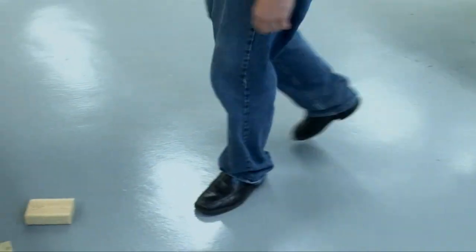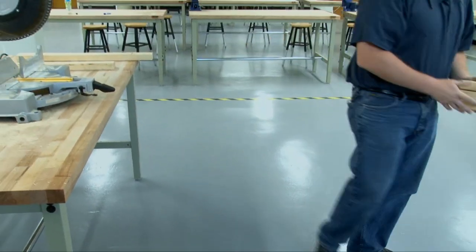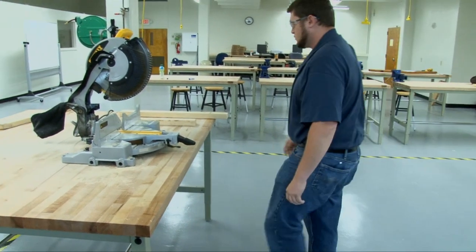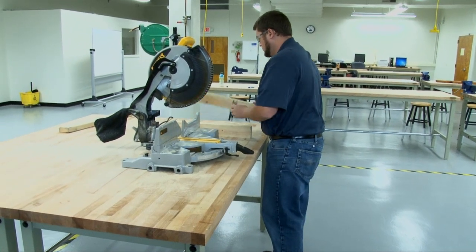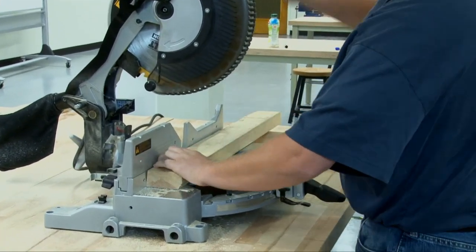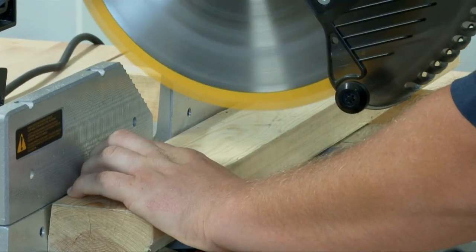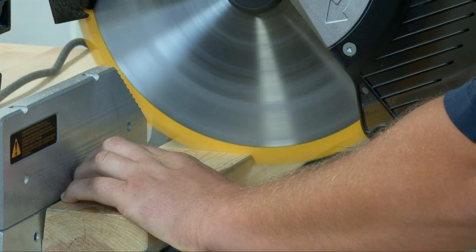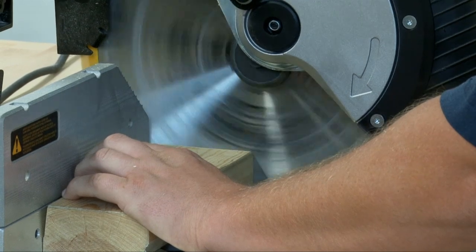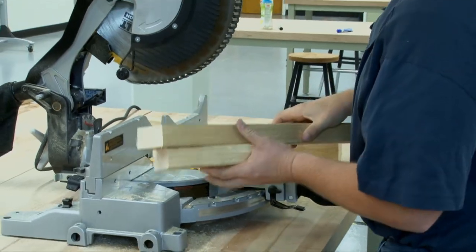When you first walk up to the piece of equipment, make sure there's no material laying on the ground or in the work environment around the saw. Make sure that if you have a longer piece of material, you have some support for it so it doesn't come back and hit you in the face — you can use a piece of material to block it up or grab a lab partner to assist. Make sure you have a good grip on the material while you're cutting and that your hand is out of the danger zone from the saw. Also make sure you have a good grip on the saw and that the saw comes to a complete stop before you retract it from the material.